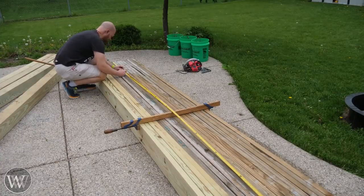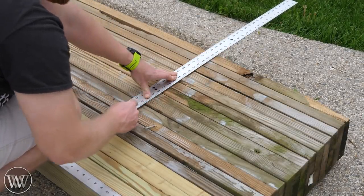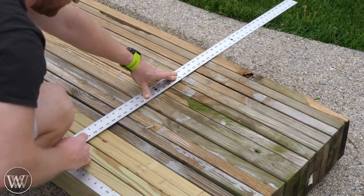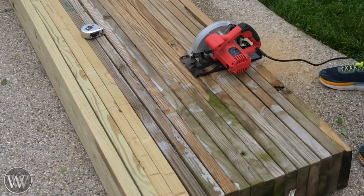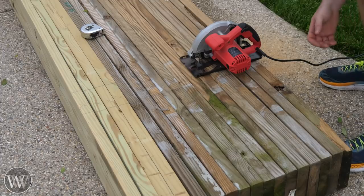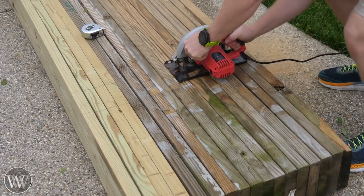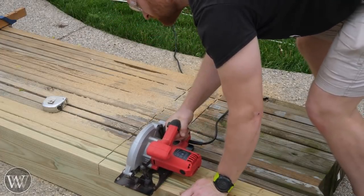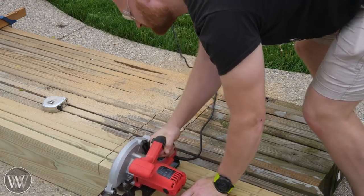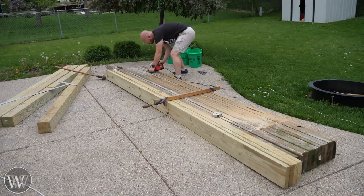The first thing I want to do is lay out where all these are going to intersect. We have the secondary beams, which are the ones I'm working on right now, that are going to get a half-lap joint that then saddle-joints onto the 24-foot-long beams. These need a slot cut out of them, and the easiest way to do that is to grab the saw and run on down them all. I want these all to be parallel, so I'm clamping them all together, evening them up, and ripping them all down.